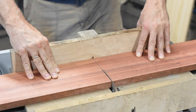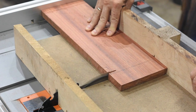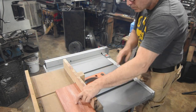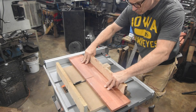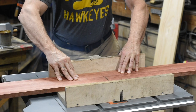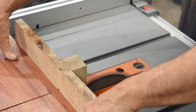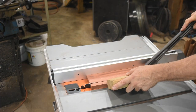The amp has a depth of 8 inches, so a sensible person would have bought 8-inch lumber. I didn't, so here's how that went. After running the lumber through my planer to thin it down from four quarters — which, as any woodworker knows, doesn't equal one inch — to get it down to about three-quarter inch stock, I hacked it into four pieces for the sides, bottom, and top, using the world's highest quality homemade sled made from MDF. I also ripped some 2-inch wide pieces to glue together to get the full depth I needed for the cab.